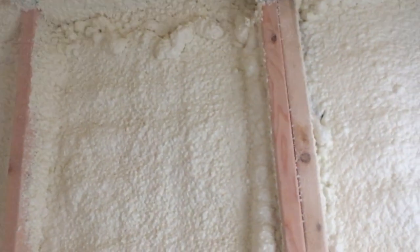This is the spray foam insulation. We chose to go with this because it fills all the cracks and gaps. With foam board you've got to tape, silicone, and use this stuff in the corners anyway, so we just went with this route. Pretty much two cans to do this whole room — those do-it-yourself kits were pretty much the same cost as buying all the panels to fill this room.